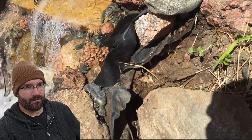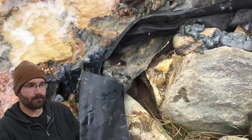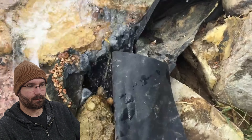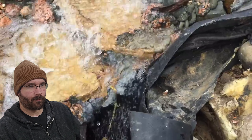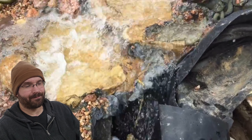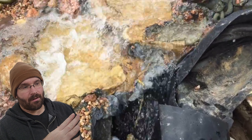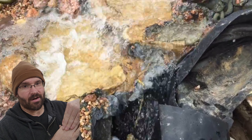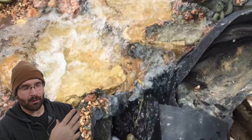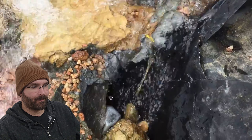Here you can see again — the liners are not overlapped correctly to begin with, and then he tried to weld them together with some kind of glue. It's never going to work. That's probably one of the worst examples of liner seaming you'll see.